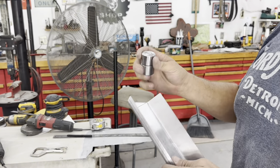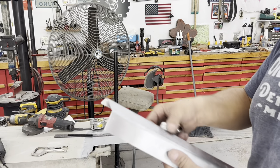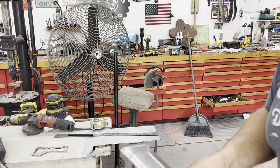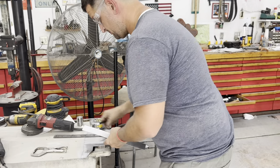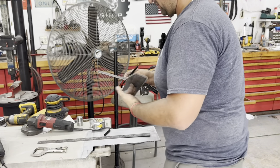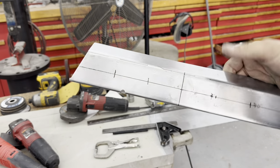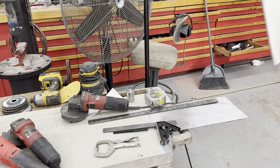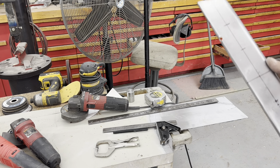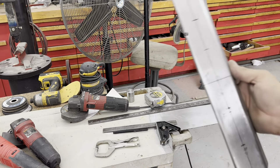The smallest dimple die will work just fine right here. I'll bust probably five holes because of the length — looks like a five-holer. I'll find the middle and then do the two on each end. I've got my holes marked out and I should probably go ahead and make the end caps and make three more risers before I start drilling into this one. So rinse and repeat — I'll go ahead and make all four and get it going.